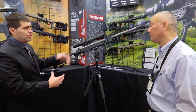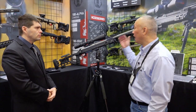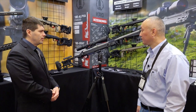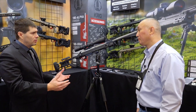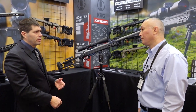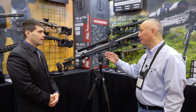We'll have a little wrench made so that you can pull the scope off and pop the barrel out without actually having to pull the whole barrel action out of the chassis. The barrels would be available through us, and users could also bring their own barrel to a gunsmith. We'll have some barrels available and we'll make the barrel prints available so that anybody can get a blank and spin it up. You just chamber it to a certain dimension, thread on that metric thread, and it's good to go.